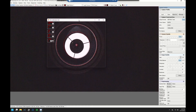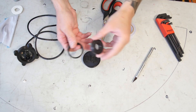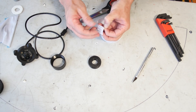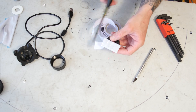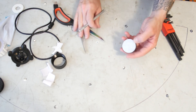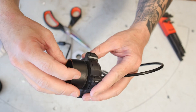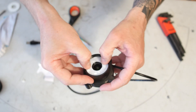From these early tests I realized we're going to need to be able to see the draw tube — the inside of the draw tube — because that will not necessarily be concentric to the shadow of the secondary mirror. So we need a reflective surface on the inside of the camera end. For that we just need a simple 3D printed donut-shaped part, and on Amazon I found some reflective tape to stick on it. I also switched to a shorter length extension tube since you don't really need a very long tube. The new reflective donut just press fits into place and we're good to go.